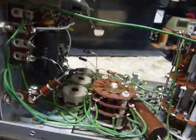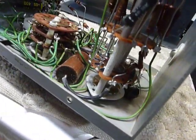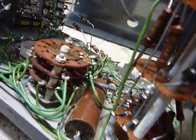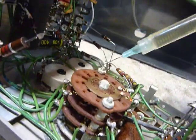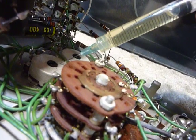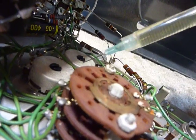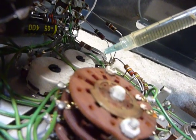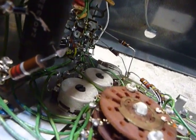Excuse the handheld camera. On the controls, I used a hypodermic syringe with some very thin 10-weight oil and put a little drop of oil in each one of the controls. I let them sit for a while, then worked them back and forth about 10 times to get the oil down in where it's needed.